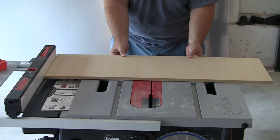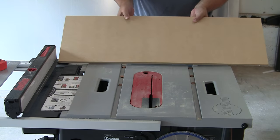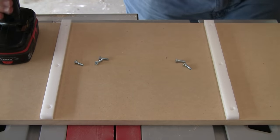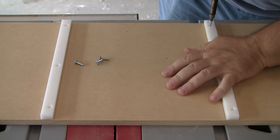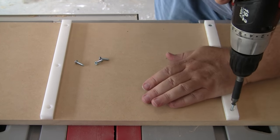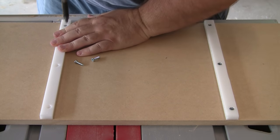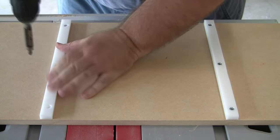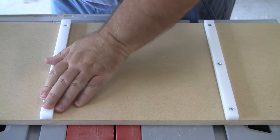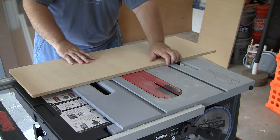Being as gentle as I can, I very carefully remove the sled from the table and turn it upside down on the saw. I used half-inch screws to attach the runners to the sled. It would have been a good idea to clamp down the ends of the runners while I screwed them down — I didn't do that, and while screwing down the ends it caused the runner to break away from the superglue. Luckily the screw had already bitten into the sled and the runner did not move. A quick test and it looks good — it's a little snug, but I'll take care of that later.